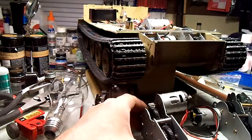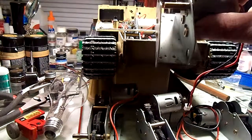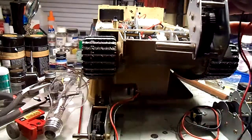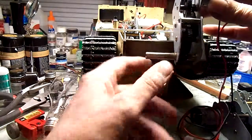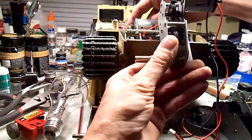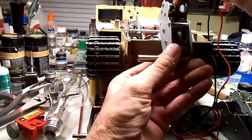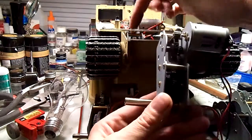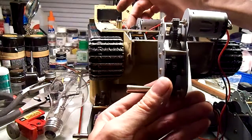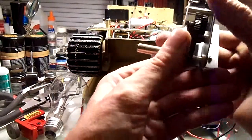Like I said, it stripped out once before. I took out another gear, replaced it, and it stripped out again. So I'm thinking — we've got these black steel gears here — as far as I can tell the only difference is that the four-to-one has this extra shaft right here. I think everything else lines up just right, so there's no reason why I can't take these gears out of this gearbox and put them in that gearbox. The only thing that'll still be zinc will be the number four shaft and the gear on the axle, but I can probably change that too.